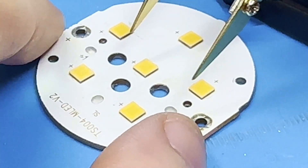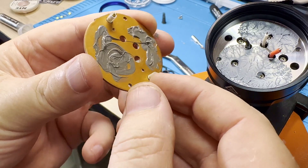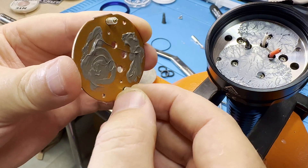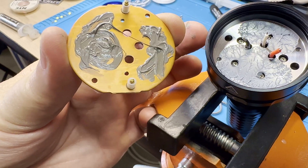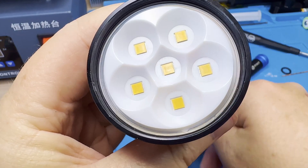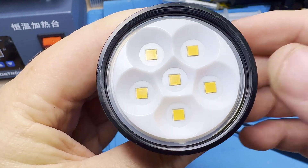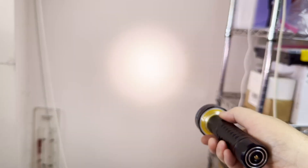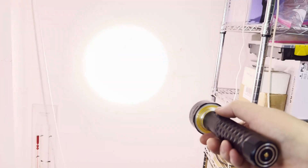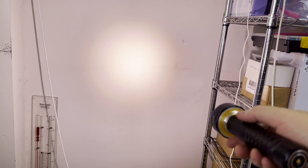Let's test that reflow — perfect. Once you've got the pins soldered back in, don't forget to put these little isolating grommets over the pins and slather some thermal paste all over the board before reinstalling it. With the glass and optic still off, I wanted to show the new emitters — they're gorgeous. The beam is more concentrated, meaning more candela because they're domeless. Great beam — you can see it's not funky, no artifacts.